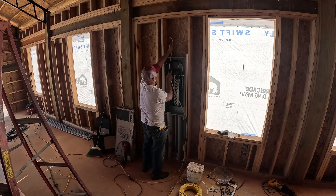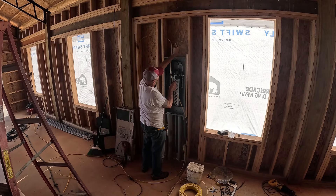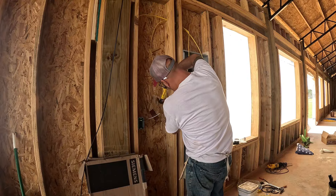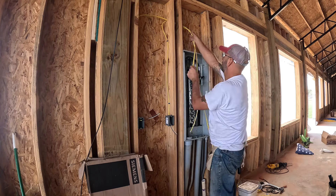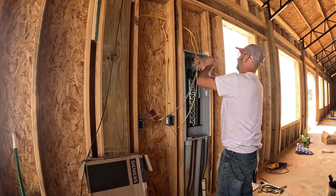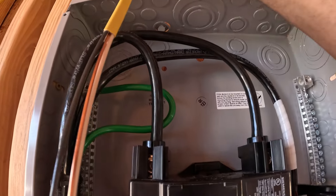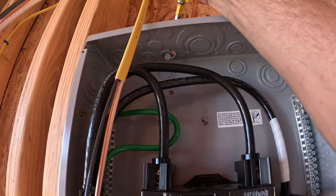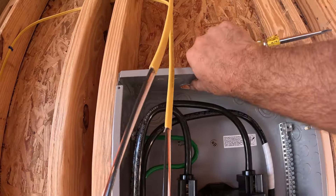We're going to float this in because we'll have a bazillion wires in the future coming in here. I'll put a block across the back and all these conductors will be neatly strung on that. We'll strip this here - that's plenty. Just a nice easy bend - easy like Sunday morning. That's the three-quarter, we don't want that one to leave. We'll put this big beefy one in the middle and gingerly twist it out. There we go - now we can put our connector in.